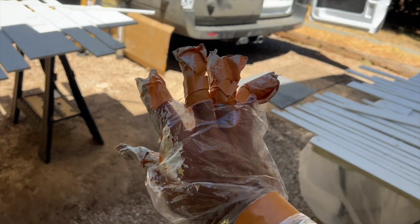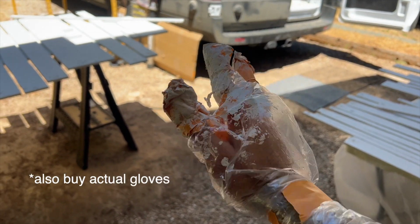Here's a tip though, a reminder maybe: don't rush the painting process. If you don't put on light coats or wait long enough between coats for each of those coats to dry, then they never will. The paint will basically never dry. It will stay tacky forever.